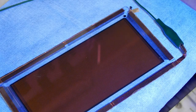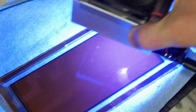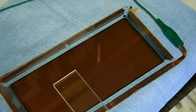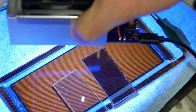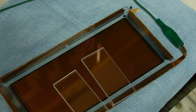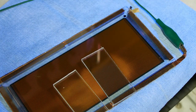This works with floodlights too, not just lasers — just a lot slower. I've got my multi-spectral LED board from last video, currently set to 405 nanometers. This has almost no effect; you can sit over this for a long time at 405nm and it just doesn't have enough power to do anything. But let's make this more interesting. I'll put two pieces of plastic on here that look about the same, and I'm going to set my LED box to 365 nanometers, which is going to have a big effect. You can already tell the two halves are behaving differently.